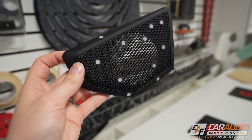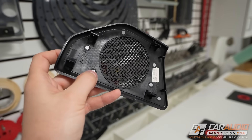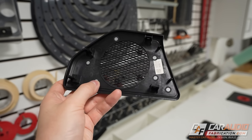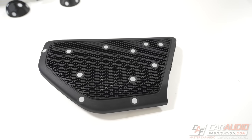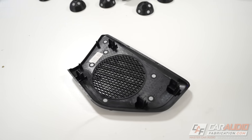Scanning dark black surfaces could raise a challenge, as the geometry of the parts tends to blend together and be difficult for the structured light to capture. Structured light also struggles with very reflective surfaces like the gloss black that we frequently see in vehicle interiors. Also, the scanner, just by nature of being an entry-level scanner, didn't have as much dimensional accuracy as we sometimes need.